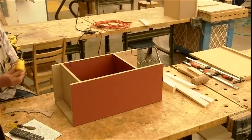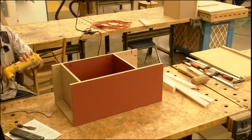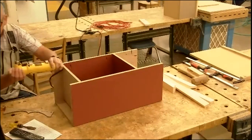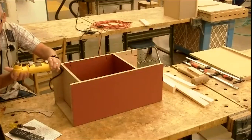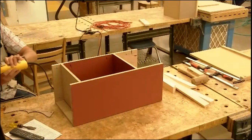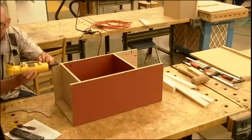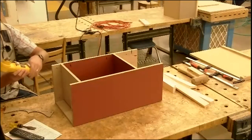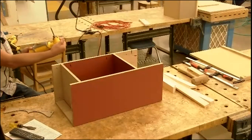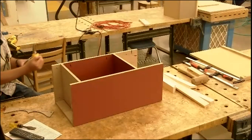The angle drill, right? It's got a nice flat back on the head. That's where your pressure comes from, right there. Okay, all your pressure's right there. We can't even put pressure on it. Here's the on switch right here on top, right? There's no way to really put a lot of pressure on it holding it like this. So you have to have a hand under here, okay? So that's where your pressure comes from.